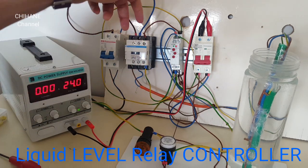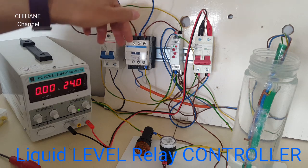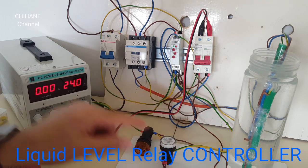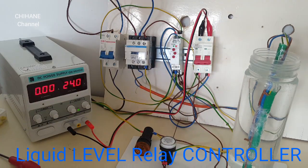There's no power going through the coil of this contactor, so there's no electricity going towards our pump. When there's no water in our tank, the water level gets lower, and what happens is the normally-closed contact on the relay turns to normally-open and the normally-open turns to normally-closed. So when the water tank gets low, the normally-open goes to normally-closed and it feeds this coil.